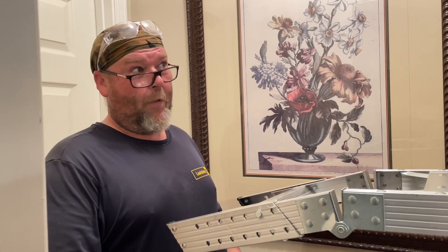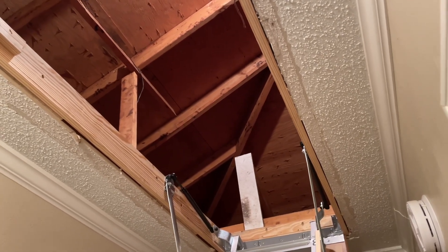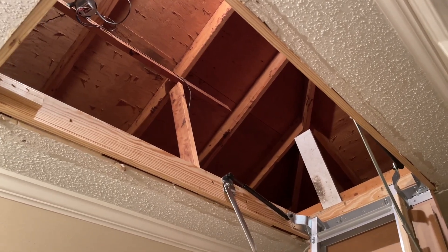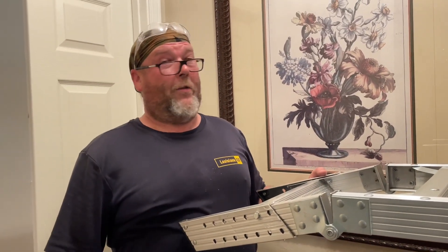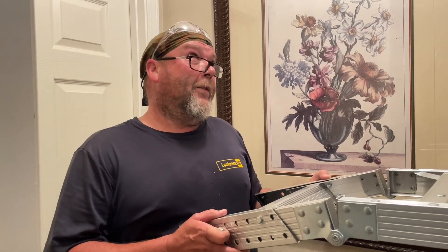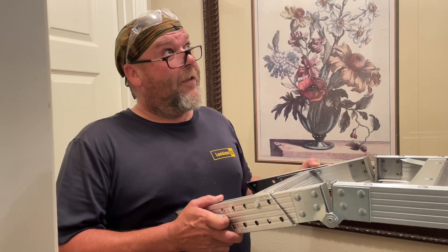The one in the garage has got to be replaced when I redo it for the closet and all that. I'm actually gonna reset the ceiling rafters out there and put the wide one. This is the narrow. Out in the garage I'm gonna put the wide one. How much did you have to cut off for the old unit to come down? I had to cut that much off this ladder — it's a kit, so you just cut what you need. And how much did you have to cut out of the attic hole? I had to take out four inches so the unit would go up through the hole — it was four inches wider than the ladder. So I had to scab it back in and put this ladder back in because it's not quite wide enough with door trim and everything. So it's going with a standard narrow, which is perfect. The one in the garage will be a wide.